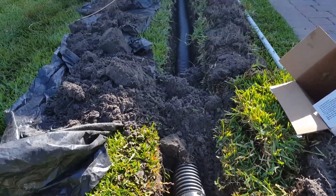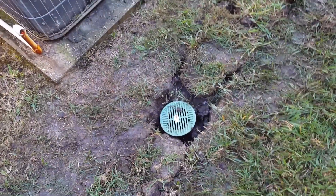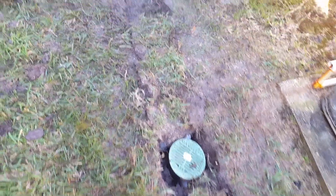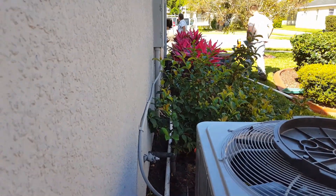There's the completed drain — now we're just going to cover and we're all done. We're backfilling; you can see how well it comes out. The sod — if you step on it, it'll just sink right back down. In a couple of hours it should be back to where it was. To recap: we've got the styrofoam peanuts used as our French drain, catch basins grabbing the surface water, and the French drain grabbing the subsurface water. That all ties into the sump pit, which lifts it up and sends it all the way out to the front. This is Chuck with Apple Drains — if you believe you can do something, I guarantee you can do it. Have a great day!